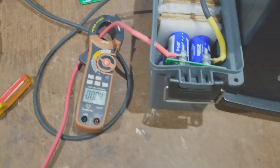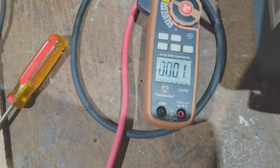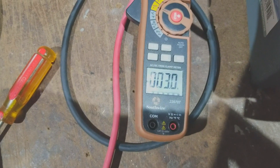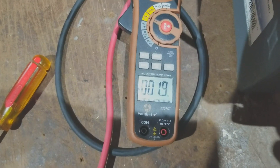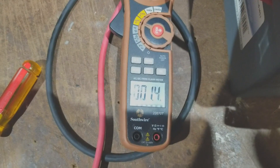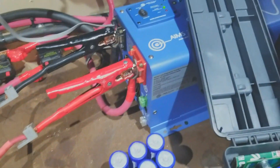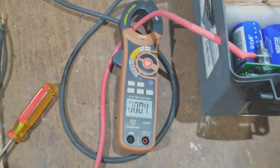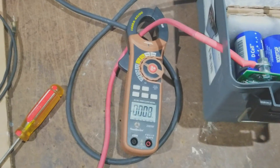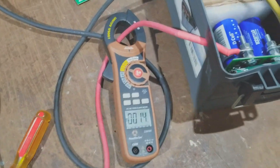To demonstrate, I'm going to turn this electric heater on full high and watch what happens — watch the amount of current amps it'll draw from this capacitor bank. It'll start out drawing about three amps and then kick to high. That little extra surge power, and then it'll settle down. The inverter really can handle the load, but the capacitor helped the load. In some of these older inverters, it helps with the surge because some of them just can't handle it.